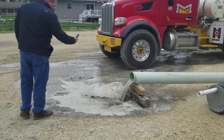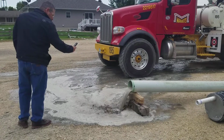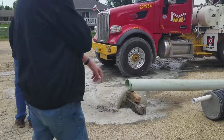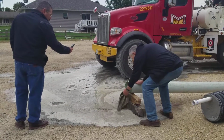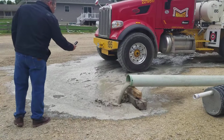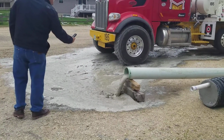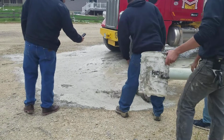Density was checked using one of our QC field kits. As you can see, once we started pumping cellular concrete into the pipe, clear water started being displaced from it. Given the small volume, the pipe didn't take long for the cellular grout to start appearing. After a few seconds of cellular material coming out of the pipe, we checked the density of the material again to see how much washout was occurring from the water actually washing foam bubbles out of the mix. The density checked out at 42 PCF, which means we really had pretty good consistency.